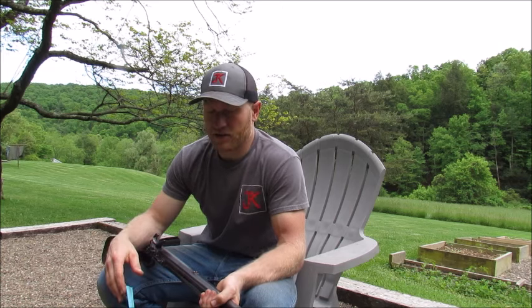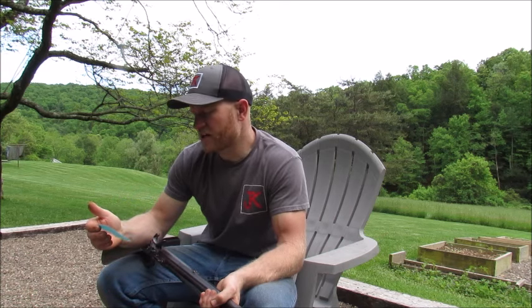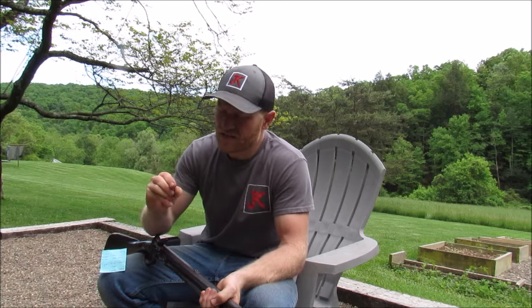I did go on the internet and look to see if I could get 16 gauge components, like overshot cards mainly. I can cut my own out, but I'd rather buy them. It's just way easier. I know this video is getting lengthy, but I just wanted to say that for my comfort and barrel thickness, what I think Bobby will hopefully be willing to do is a 14 gauge, .693 inches. That's 0.088, 88 thousandths of an inch for the wall. I mean, 88 thousandths is plenty of meat.